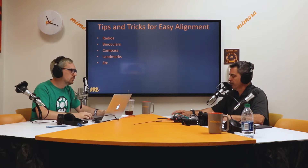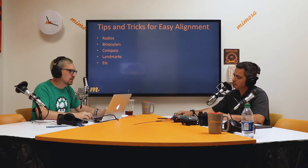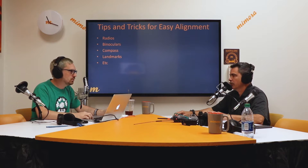We're looking at point-to-point here, and you still have to pay attention to the side lobes and the primary lobes. That's even for point-to-multipoint clients too, although you're usually going to be a lot closer with those and they shouldn't be so difficult. But you need to take that into consideration for all radios that you're deploying, not just point-to-point.